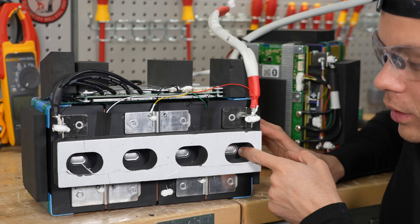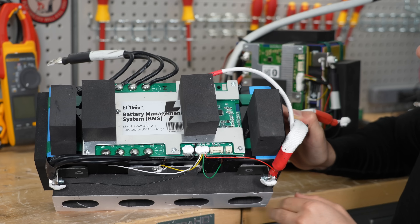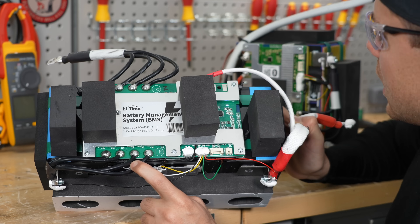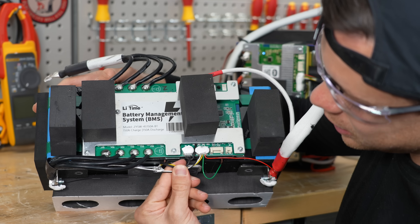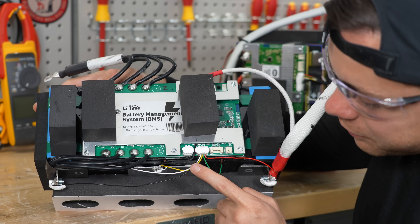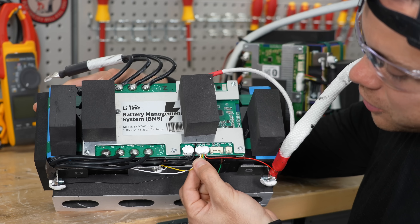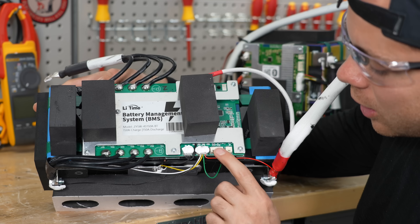Now let's look at the other battery. The overpressure relief valves actually have holes in the foam — a lot of batteries don't seem to have this nowadays. The build quality is pretty much the same and they really want you to know that they make these in-house. This one is rated for 150 amps so you have an extra supply conductor. Another thing — this was held down with a piece of tape but these wires are just floating out in the open. It shouldn't hurt performance, but a lot of the competition now has a very protected balance cable. The most important thing is if they glue it in place, because sometimes these pop out during shipping and your battery will be dead on arrival. That's pretty uncommon with these Leetimes.